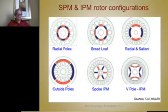This is a steel magnetic band or cup, can have a flange on it, and the magnets are usually shaped in arcs, and they're bonded to the inside of this with epoxy or Loctite adhesives. And these magnet grades are nearly always ceramic grades or bonded neodymium grades, unless you're talking about a great big unit like this that you might use in a direct drive wind turbine. Then you could use rare earth in here. Otherwise, in a small machine, you won't have enough space in here to carry the flux of the rare earth, plus wind up with enough room left for the windings.